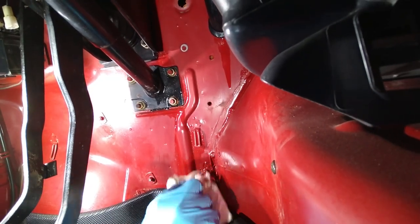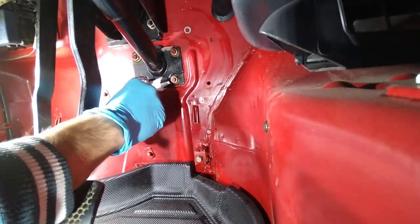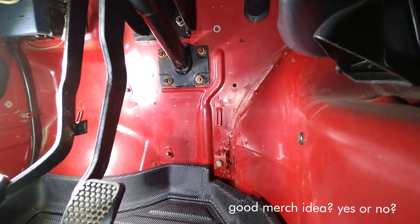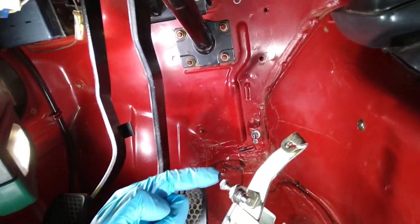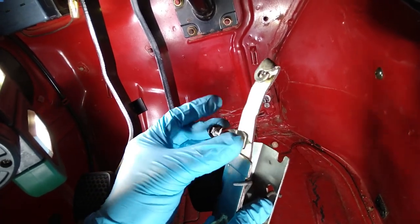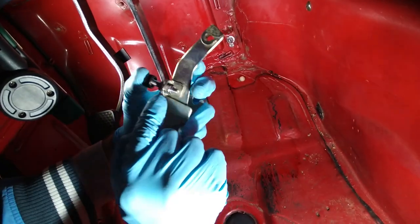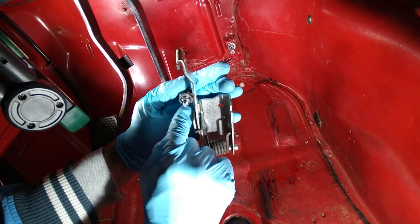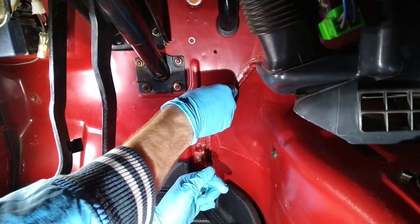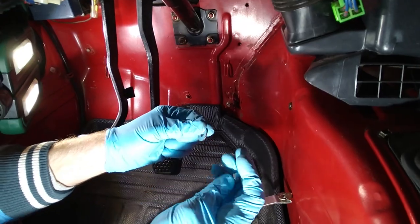This is the other stop. Now let me find some screws. I hate previous owners. I adjusted this screw to be out by some amount. I will put the cap back on. We are going to screw this back in. Now we know how it works — it has a lock nut on the inside which I replaced with an actual nylock nut. This is M6. Washer.